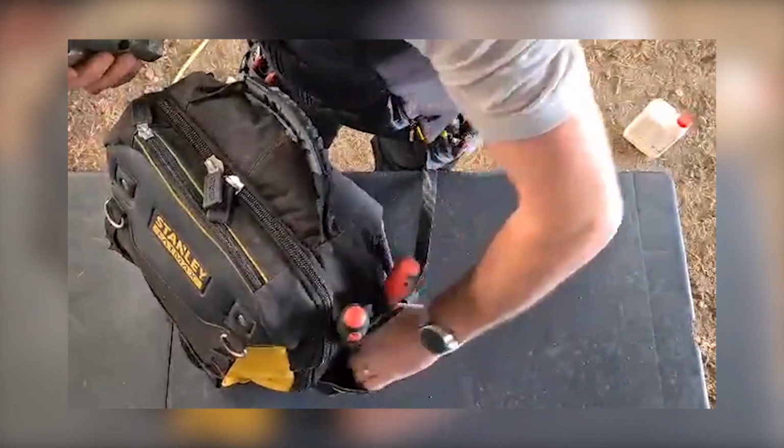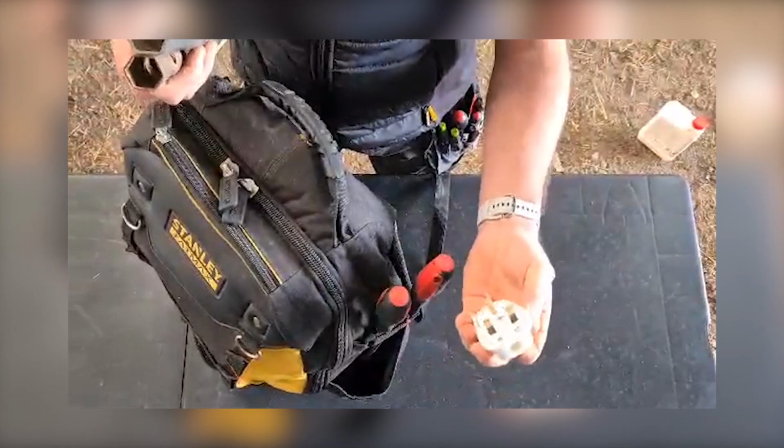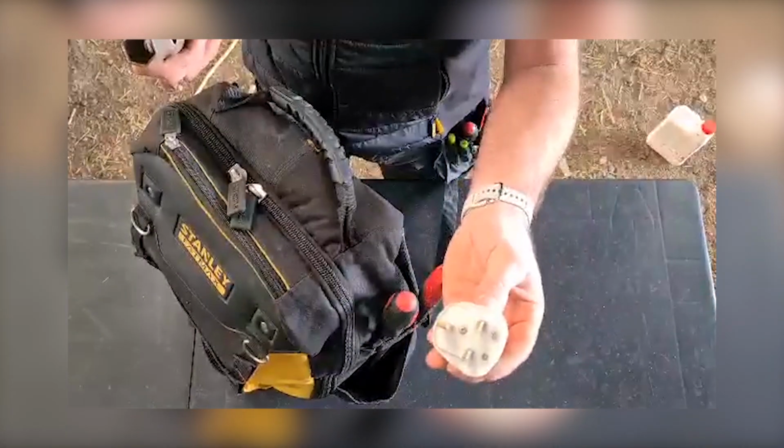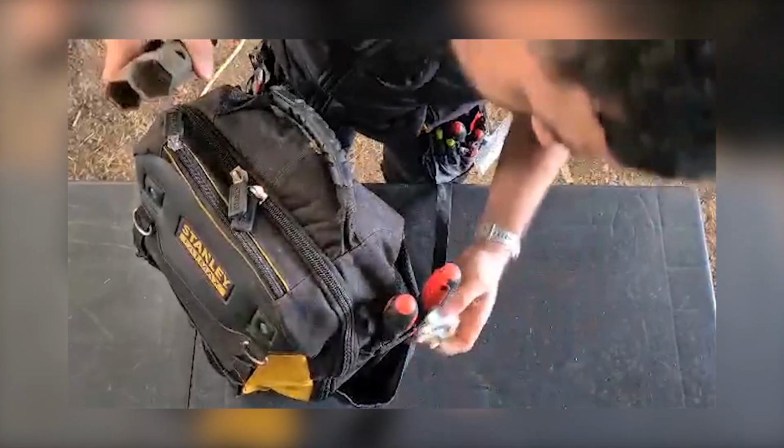Bag here for little things, got a spare plug in there if I'm ever doing a boiler breakdown and the controls or anything aren't working, or some fault down the line. Just to prove that the boiler is working, I will just wire it up on a flex lead, plug it in, prove all external controls aren't working, the boiler is. So just little tips and tricks there.